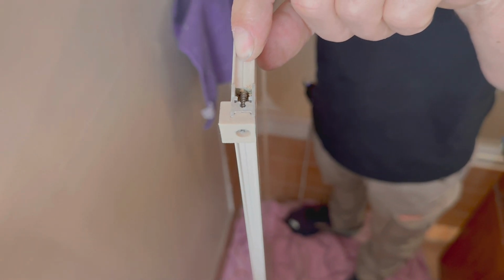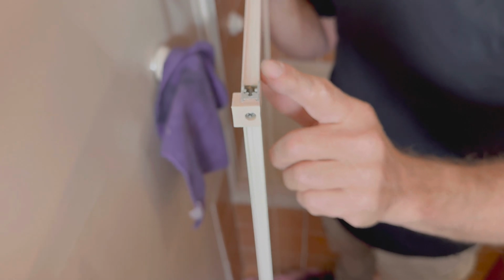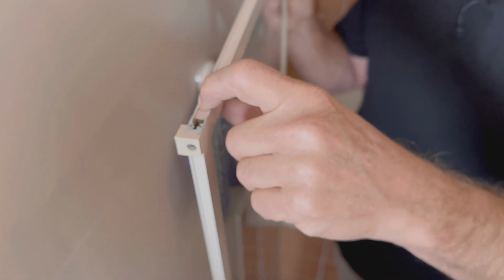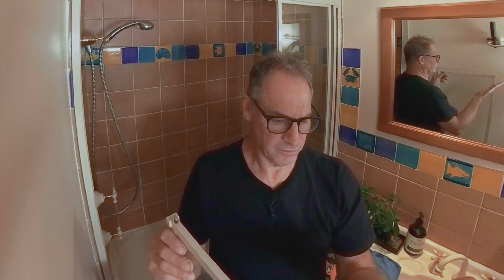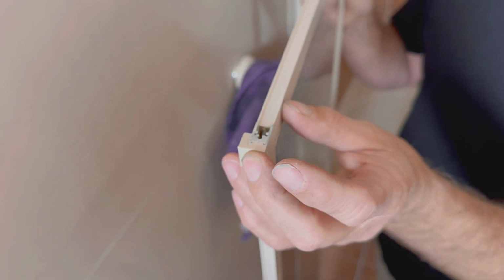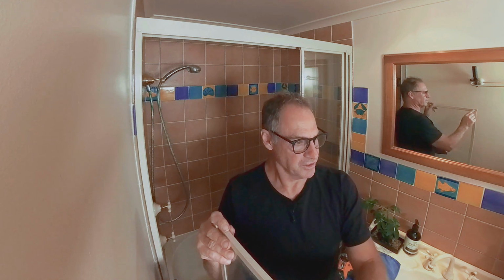Framework here, it's a stainless steel screw. It's a 6-gauge screw. It'll be a 1.5 inch screw. On the inside of here, I can't get any spray or lubricant in there to actually release the screw. Given the age of the screw, there's going to be electrolysis. That's the reaction between the stainless steel screw and the aluminium. There's an electrolytic reaction, and what happens is the screw actually gets soft and the aluminium corrodes.